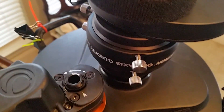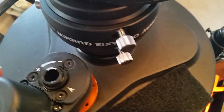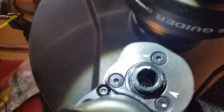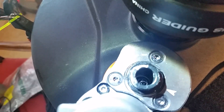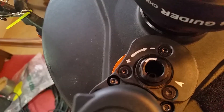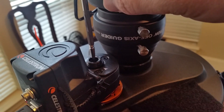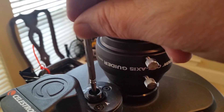As I went to Astrophotography Tool, this is what I would see on the screen. If I try to adjust it by a step of 50, it kind of locks up because it isn't actually moving the focuser, so I have to stop it. Nothing in fact has changed on the focuser — you would expect this part of the focus motor to rotate. Down inside the focuser here is a Phillips-headed screw that is attached to the OTA, so it should rotate with the outside marking of the focus motor when the focuser is operating normally.